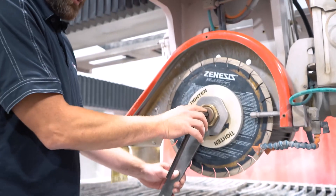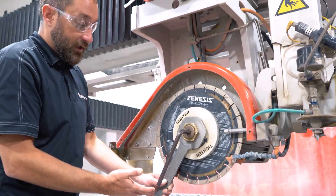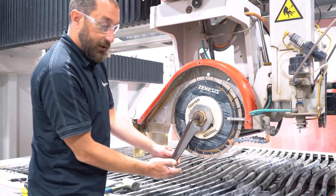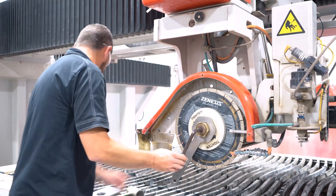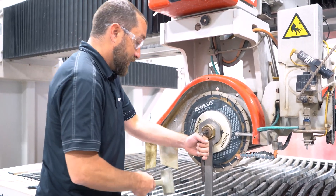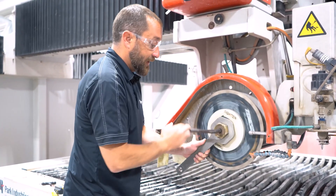If you're having issues with your Allen wrench in the center of the arbor, you can touch your blade off on your table. Put some slight pressure on it — don't put a lot because we don't want to break any segments off if it is still a good blade. But you can put some slight pressure on there and then just use the bigger wrench for the brass nut to remove that. Hold your Allen wrench and give it a couple taps. It may be a little harder to remove if that blade has been on there a long time.